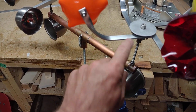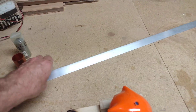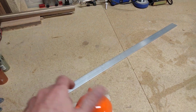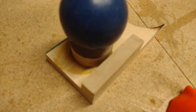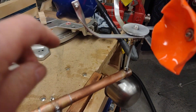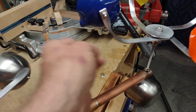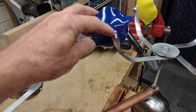This is half-inch by an eighth-inch aluminum — you find that in hardware stores. This is actually a one-inch piece since I didn't have any half-inch left. You can form it by making a slot about the right size for the aluminum, then just bend it by hand around a circle to make bends. I then clamped it half in a vise, grabbed the other end with a wood clamp, and twisted it.